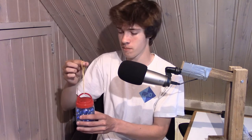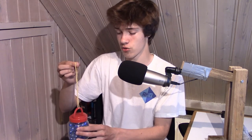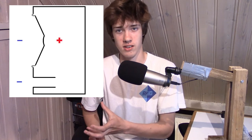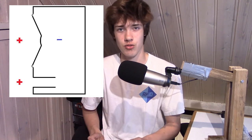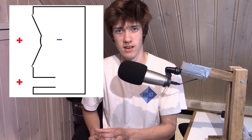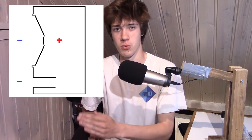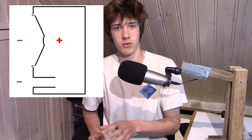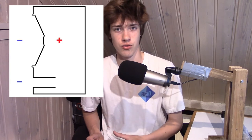When my hand moves out, away from the center, so does this mass — it also moves out. And when my hand moves towards the center, so does this weight. Translating that to our speaker: when the cone moves in and the air inside gets compressed, the air inside the port also moves in, and when the cone moves out, the air inside the port also moves out. The air inside the port is now in phase with the cone.